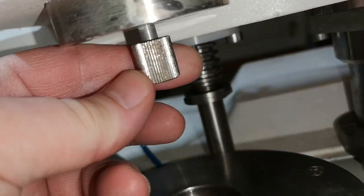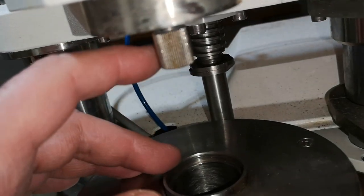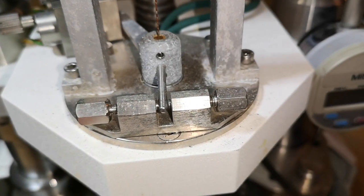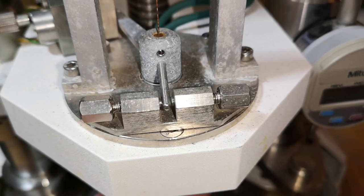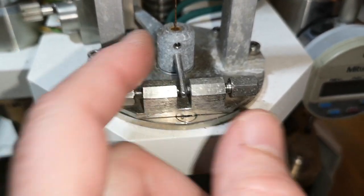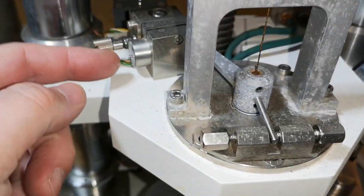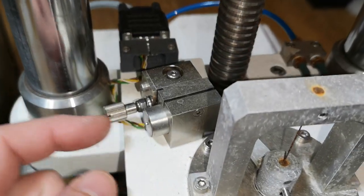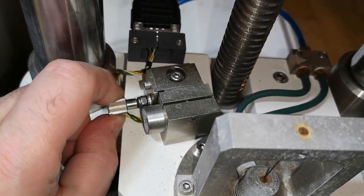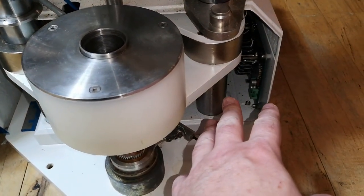There's some sort of an interface here where you can screw a test fixture that goes to your test sample. This whole device here can actually move a little bit left or right, and there are two finger screws where you can adjust position. This long arm here goes to a sensor of movement, and if I move this, I can move the trigger point of that sensor, which goes via cable to an electronic board interface down here.